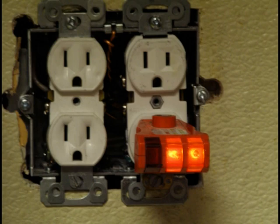Please forgive the fuzziness, but you can still make out that the branch box is properly mounted and grounded with the ground clip, all ready to be trimmed out. In this picture you can clearly see in the top center of the remodel box there is a ground clip affixed. The box is trimmed out and the tester tells us that it is grounded and properly wired.